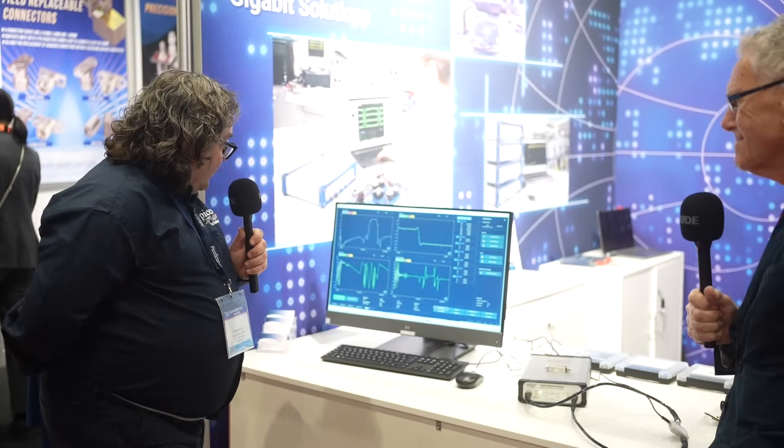If you have any questions feel free to contact us at Pico Technology. We've now moved across the Pico Technology stand and Stuart Merlis is going to talk us through the Vector Network Analyzer. We're one of the other instruments in our RF business - the Pico VNA, with bandwidth from 300 kilohertz up to eight and a half GHz. In front of me we are looking at a bandpass filter with our recently updated VNA5 software. The VNA5 software supports standard testing of S11, S21, S22, and also supports our API functionality with SCPI, making it very versatile.